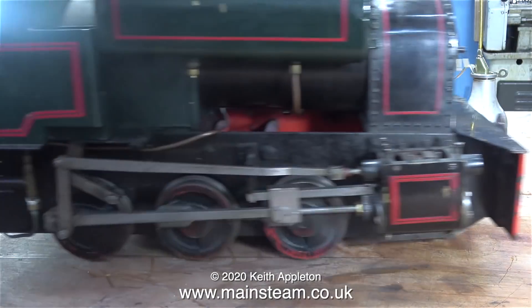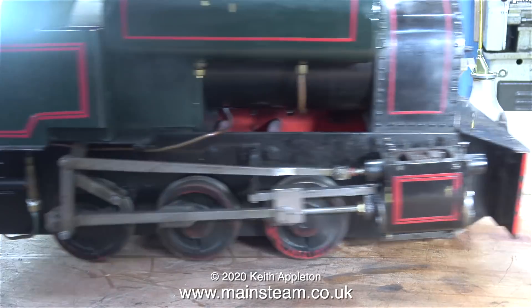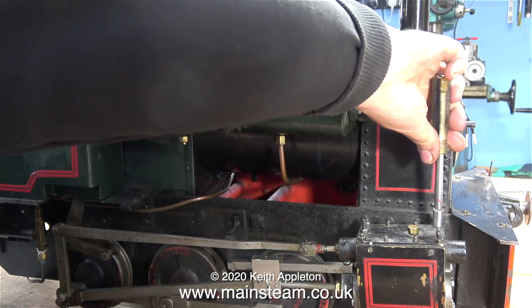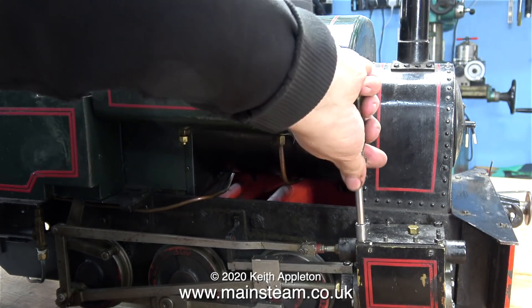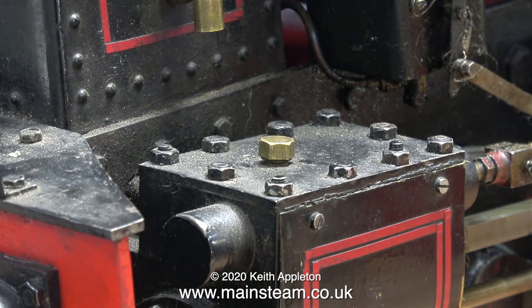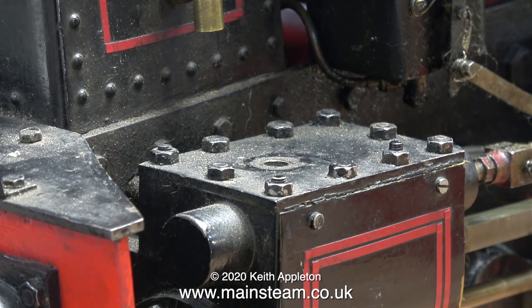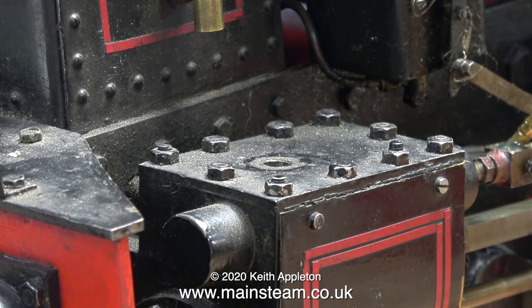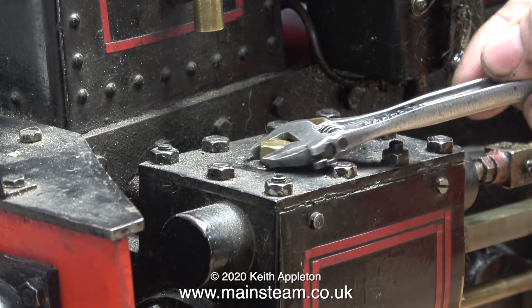Here's the part I've been waiting for. I ran the engine along the bench and it ran very smoothly indeed. Because the valve linkage is very sloppy and broken, the movement of the valves is very restricted. At this stage I thought it would be a good idea to refit the steam chest cover, not forgetting to put some oil into the other steam chest by moving a small brass plug - I'm pumping plenty of oil in there. I then went around the engine and oiled all the other moving parts.